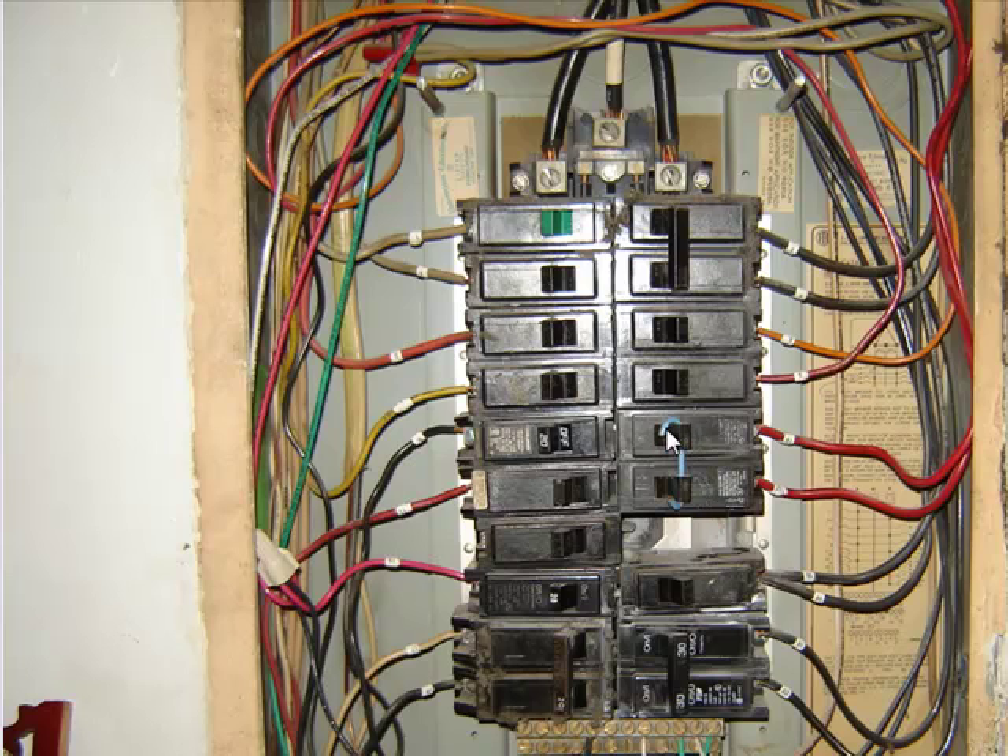On this one here, you've got a self-made two-pole breaker that goes and feeds the ice machine there. And we've got some doubled-up wires on here, which I found out yesterday after doing something else — we've got exhaust fans and make-up air under the same breaker. There's just all kinds of crap, different size breakers in here.